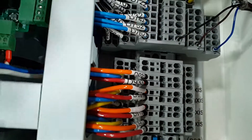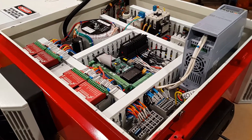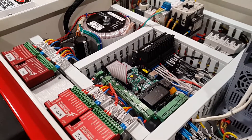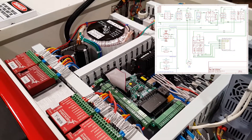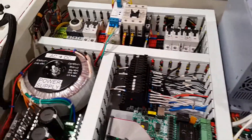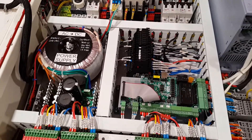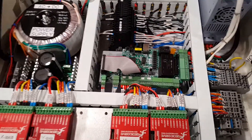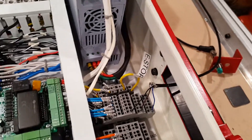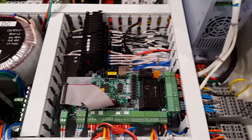These are all the motor outputs — each one is one stepper motor with that expansion. It took a lot longer than I thought to wire this thing up and get all the cable labels done. I definitely recommend having a schematic — you can write it on paper, but you need something to follow because it quickly turns into spaghetti junction. I've done some QA testing and have proof of life: all motors are functioning, and I've done initial testing on the proximity sensors — it all seems to be working. My next step is more testing on the spindle, then mounting it and getting the final connections done. Thanks for watching.